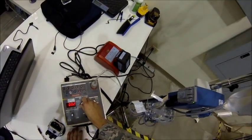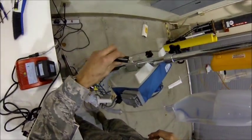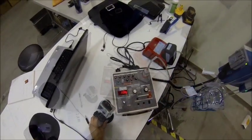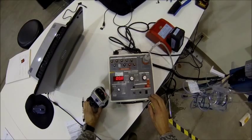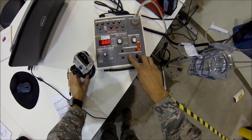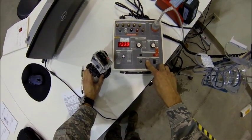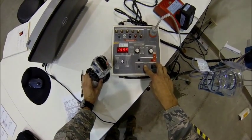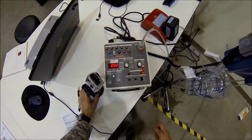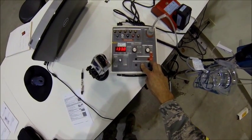Of course, you can check your power cord resistance by putting on your Kelvin cable. You can go directly to the pole clamp if you have to, because the grounding point is at the pole clamp. You are going to switch over to external lead. Make sure your polarity is in normal, and then you're going to open the ground to see what the leakage is. And you can see we have 133 microamps, well below the threshold of 300. You can switch over to your ground conductor and see what the leakage is there. Most of the time those are both the same if you have a good ground.